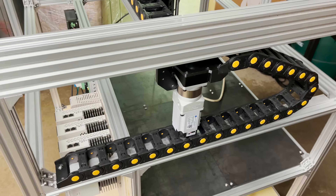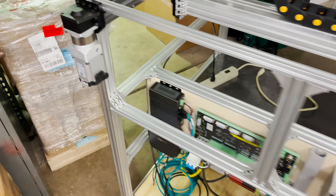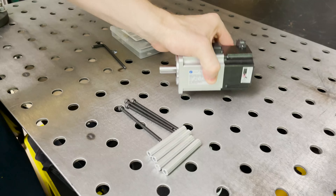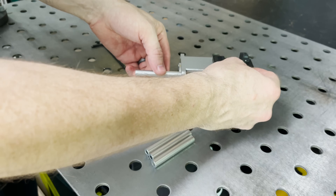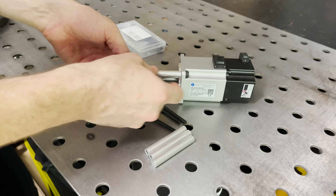That looks really good — X, Y, and Y all mounted. Now let's get the Z axis installed on top. For the Z axis motor we're going to do it a little different: I've got these aluminum spacers and some 90 millimeter M5 screws, so they're going to go through there, down, and attach to the top of the plate that I made. I think we want the cables coming out the back.